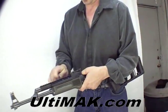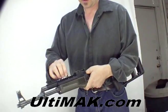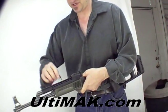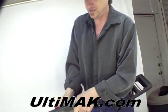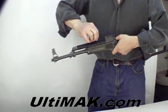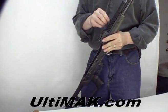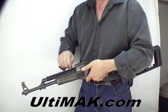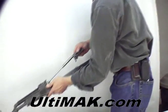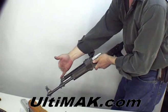This is alloy steel screws into a 4140 steel clamp. You're not going to strip those threads unless you have superhuman strength. Do you have a torque wrench or an indicating wrench? We don't. We could give torque specs, but how many people are going to have inch-pound torque wrenches in their homes? No, I just meant to say that you could show. Right. You could say, look, here's a torque wrench. It's indicating how much torque we're putting on this. It's not stripping out. You can use a lot of torque. With this little wrench, you're not going to overdo it. Maybe Schwarzenegger could be a problem, but the worst thing that's going to happen is you'll break a screw. Okay, that's tight. I can't move it any farther. We just want to make sure it cycles. That easy transition for the piston between the tube and the block.